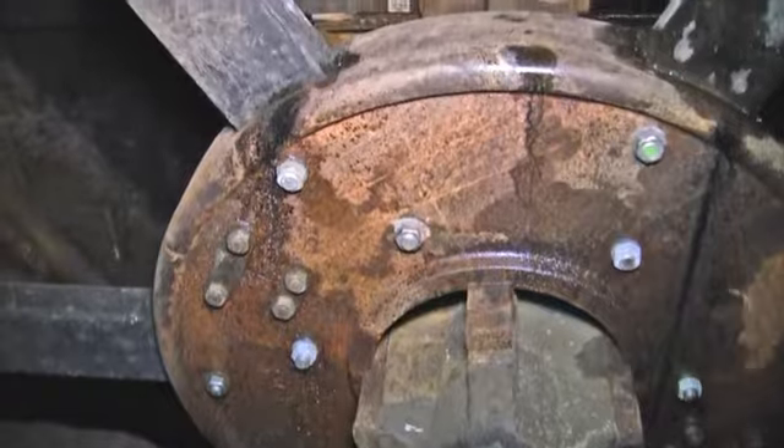From there the water runs out and under the road, so that's it from the water side. Those water wheels turn the gears, and through the gears the drives go up to the mill stones themselves. We've realigned some of the shafts because some of the stone had sunk, so we've lifted blocks and shafts around. We've actually had to replace some of the wooden teeth within the gears, reshape those and put new ones in, and then finally up to the mill stones themselves — we've opened them up, refaced them so that they grind properly. Really we've overhauled every piece of machinery within the mill to restore it back to where it was the last time it was working as a fully functional mill.